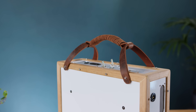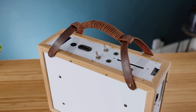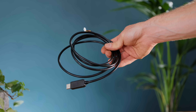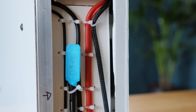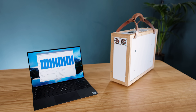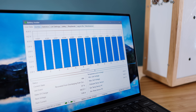Before using it, the BMS needs to be configured to tell it what kind of batteries it's looking after and various safety parameters. While this can be done via USB, I added a Bluetooth module earlier so I can connect wirelessly to it from my laptop to make the necessary changes. I like being able to check event logs from here to see how it's been performing, as well as monitor the balance voltages in real time — super cool.